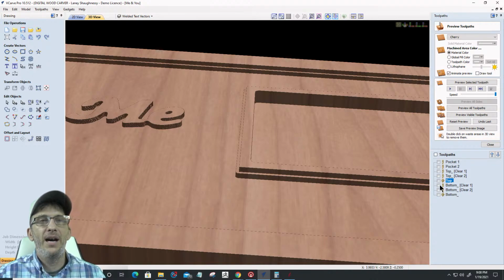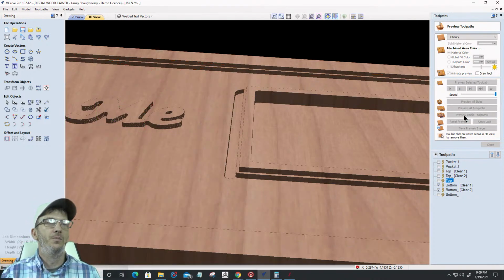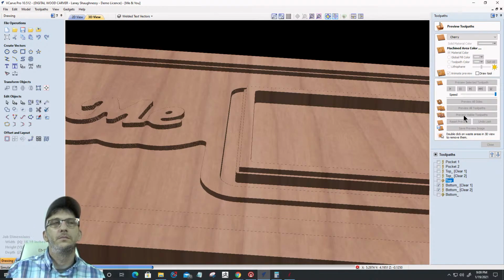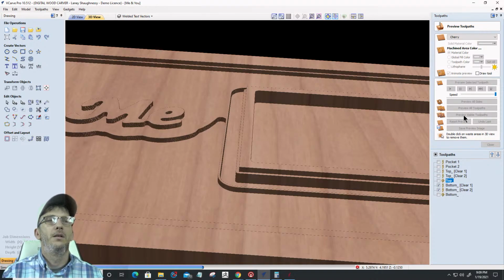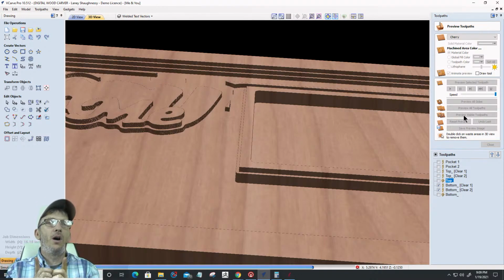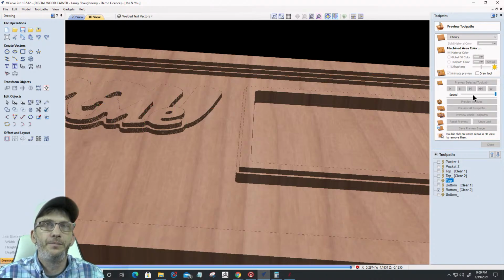All right, so if I run the bottom pockets, that 1/4 inch and 1/8 inch end mill, I should create a third step. No, it's not a third step. It is only creating here. Okay, my total offset is that 0.014. So that's the total offset, that step there. Now we're going to slow it down, and I'm going to draw the tool. Let's slow it down a lot.